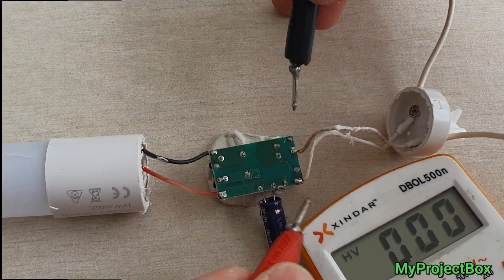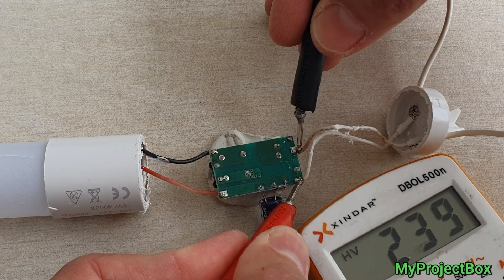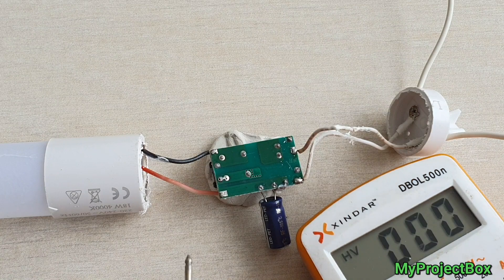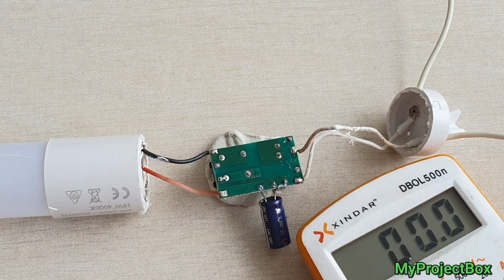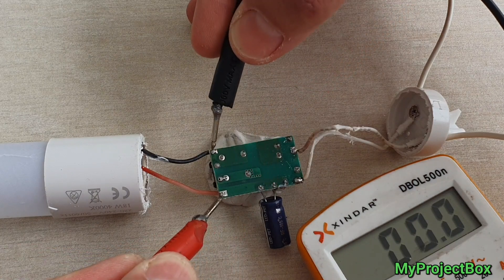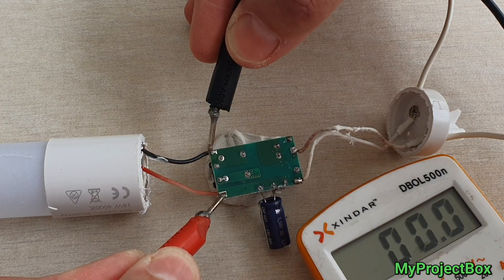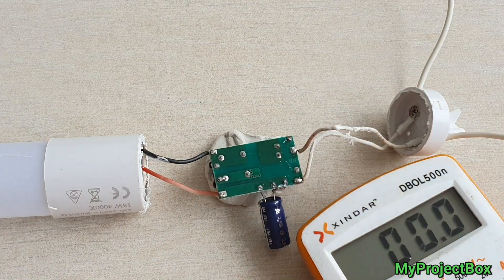I think if the driver is faulty I might just try and make a simple capacitive dropper — that should work. So we're getting an input voltage of 240 volts. And if we check on our DC setting, we should see a voltage on this capacitor here, but I don't get any reading there, and that's directly connected to the output. This capacitor is sitting across the output here. I would expect to see something like 60 volts or more. So something is wrong with this LED driver.